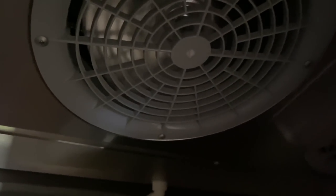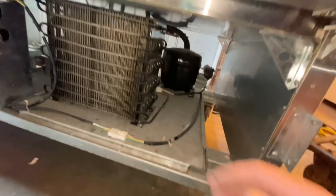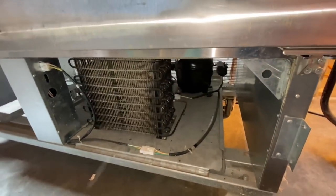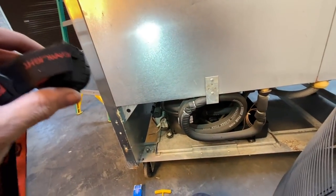I heard the evaporator fans come on, but not the compressor. We do got a door switch here. All right, we got evap fans. Don't have compressor leg. Let me see if I got voltage to that. Okay, everybody's running. Doesn't mean it's got gas. Let's see if there's a fitting. Okay, compressor runs. I got everything bypassed, so the controls smoked because it got plugged into high voltage.